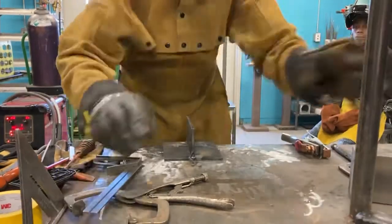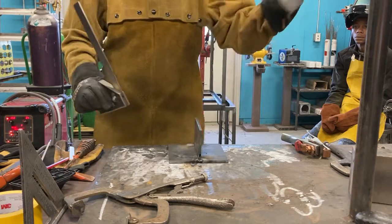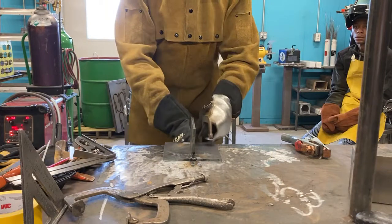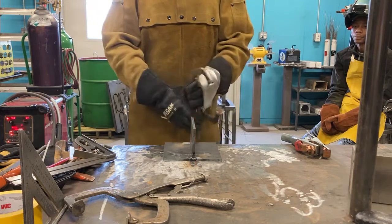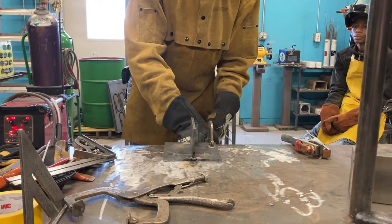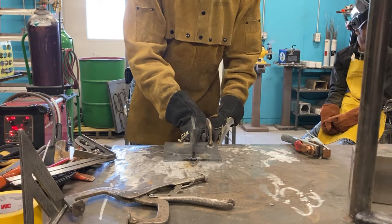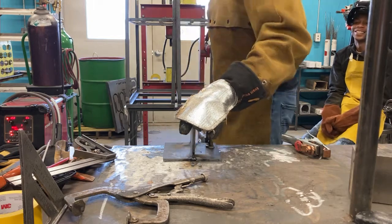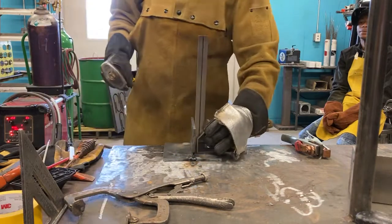So, I'm going to move it that way. To move it that way, first things first, let's clamp it down, because if I have this just sitting here and I bang on it, it's going to go flying over the table. So I need to fix this thing down so that I know it's going to stay where it's put. When you're working on stuff, always keep that in mind: where's the force going to go? It's going to go somewhere. Yeah, you're going to tap that while it's still semi-warm, right? Yes, if possible, you want to whack on things when they're a little on the warm side.